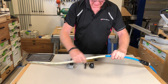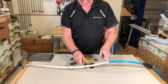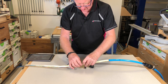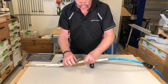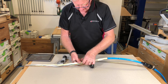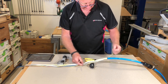Now what we need to do is cut back the Kevlar so we've got a length of about 170 millimetres. The length isn't critical because we trim it again when we fit the gland. It is helpful to try and keep the Kevlar in good order and not all tangled up, as it makes things very difficult if it gets tangled.